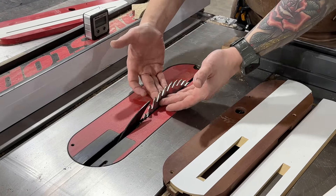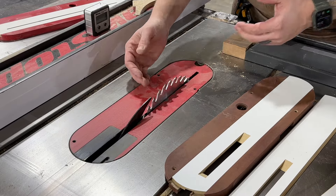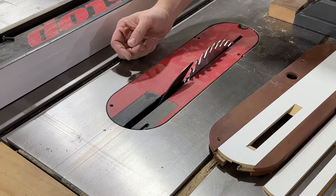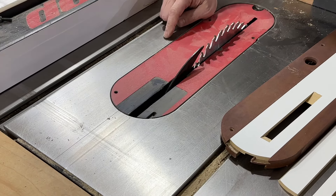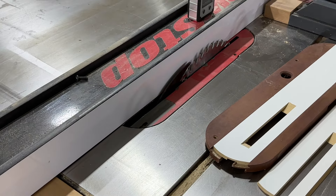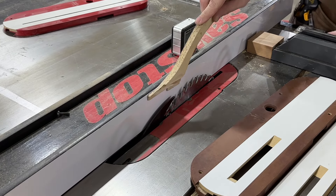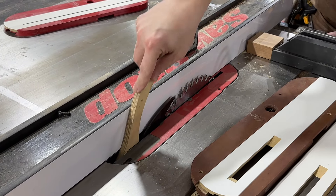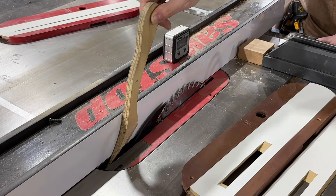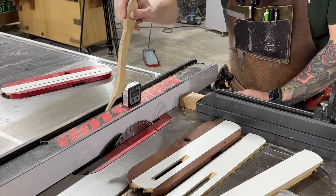Back here it's not too bad — not perfectly tight. This has been opened up a little bit from some bevel cuts, but fairly tight here. But you can see we have about a half inch gap here. So if we were to make a rip that was say a quarter inch, when we pass through, your piece is going to want to go right down inside there. This is a piece of half inch Baltic birch and it drops right in there. Very dangerous.